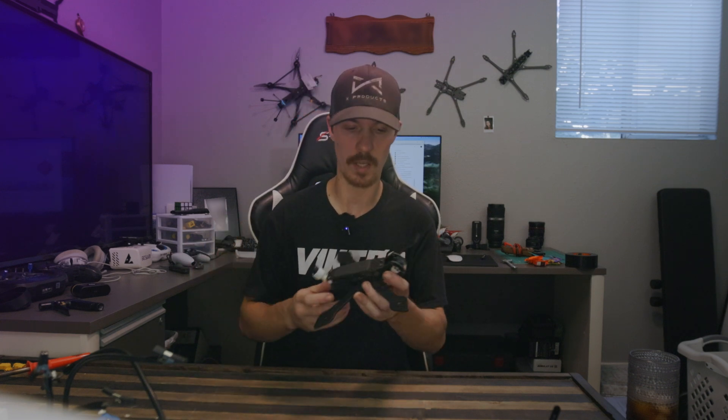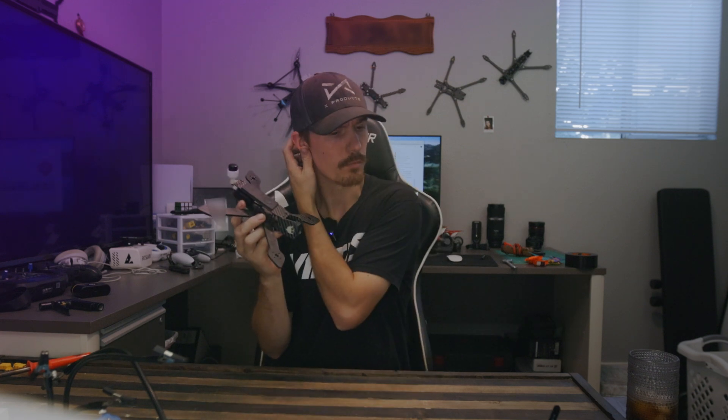How's it going everybody? This video we're doing a freestyle build — or rather a rebuild. I've had this quad for maybe about a year now. It was a pre-built from Rotor Riot and it was great for about a year, and then I started having issues. I'm not sure if it was the flight controller or the ESC, but basically when I would hit my arm switch, I'd have three motors spin up and one of them just didn't do anything. When I disarm, I'd get the startup tone again like the ESCs were out of sync.